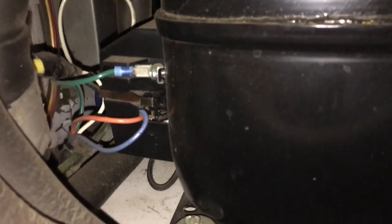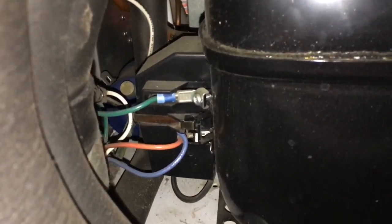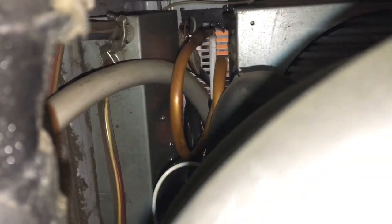So it's going to be one of three things: the condenser, I don't like that - that's pretty dirty. Start components. Or inside the box - the electrical box in there, a burned wire. These units are common to have that problem in there, wires get burned inside.